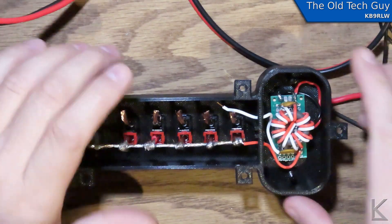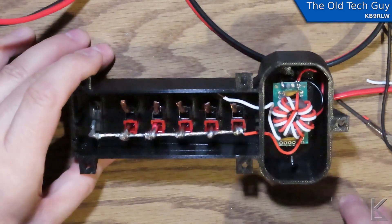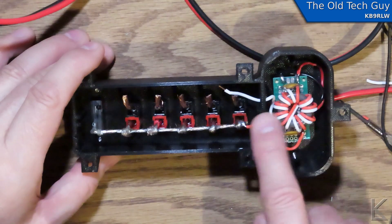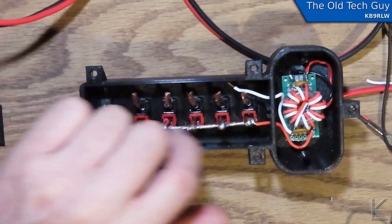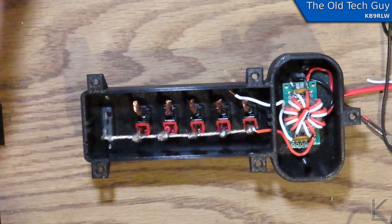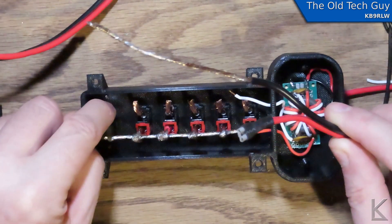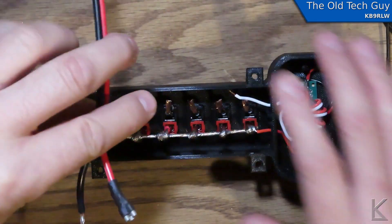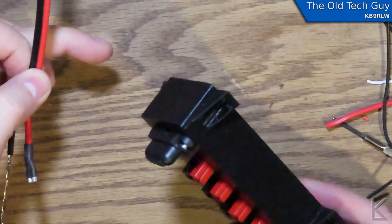So I'm in the process of wiring it up — I've got it partly done. The filter board tucks right in here real nice. You've got to watch polarity, of course — red is positive. That's why I used red and white wire, so I could follow it straight through. For the fuse, I've got a blade connector and a bus wire that runs down for each of the positive sides. Here's the incoming power line — I've got a blade connector that's going to connect to that side of the fuse, and I've prepared this side as a bus that runs down there. All of these are going to connect to it. In my case, the power wire is going to come right out of the back through a hole in the wall behind where this is mounted.